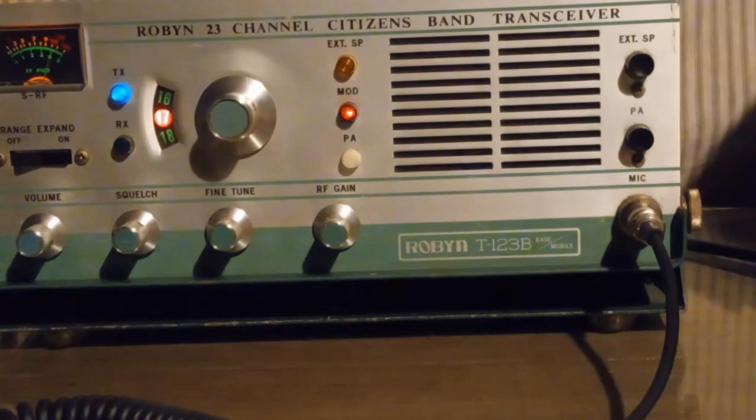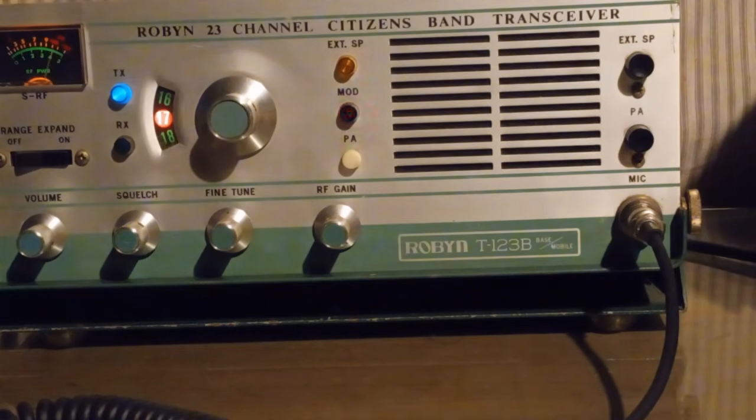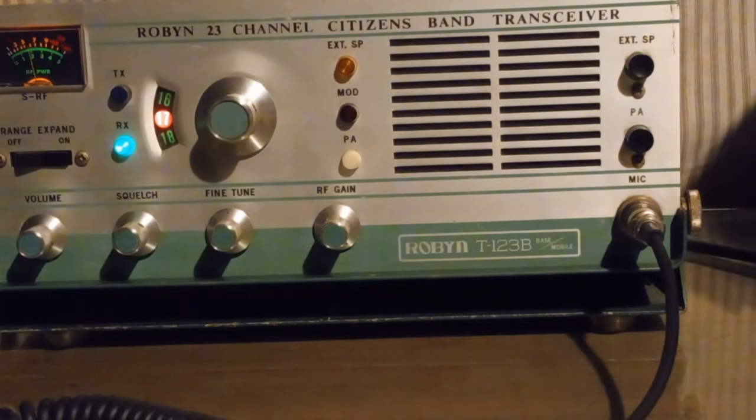I know you're probably just going to have this radio up on the shelf. But if you use it and you decide, hey, I love this thing, it's got a beautiful receiver, we can always go back and address that. Being as you have all the original tubes, it probably doesn't really need much of an alignment. It's usually when you replace the tubes that you want to align the radio to the tubes. So you're probably pretty dead on without doing anything. Right on, man, I appreciate it.